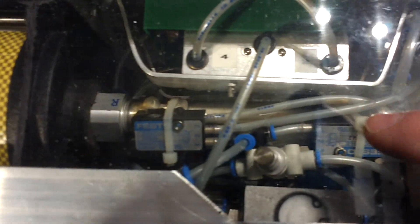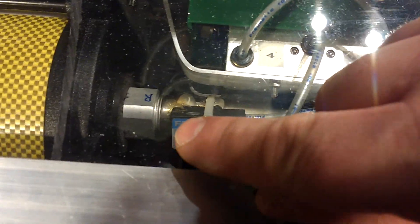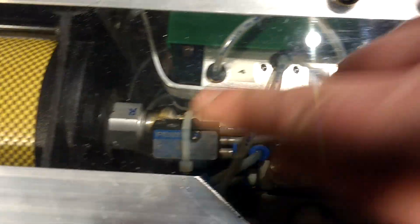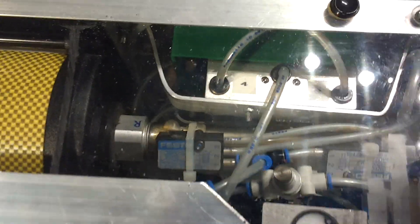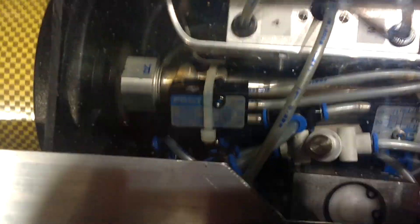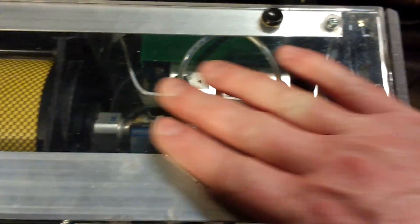These things are magnetic valves, so when the piston moves to a certain position, this trips and the logic gate flicks across and changes state. I actually can't see where it is so it's under here, and the gas pathways change and the piston moves back the other way.